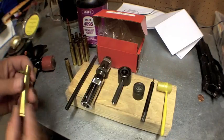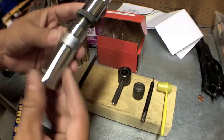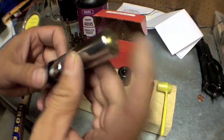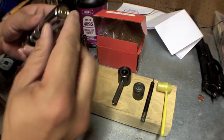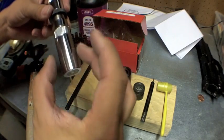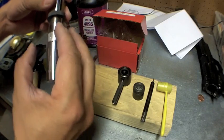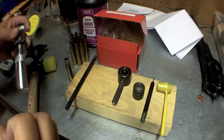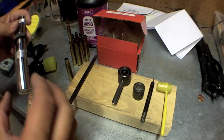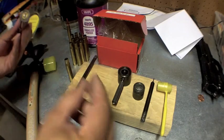I have my kit here. I'm going to grab my brass and resize it. I do that by putting it in the very bottom on the larger part of the die and I'm going to use a little mallet — just hammer that until it's fully seated. It's going to resize and re-neck the brass so it forms to its correct shape, because when you shoot your round it can slightly deform the brass casing based on the pressure. Once that's done, I'm going to prime this.